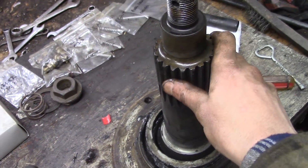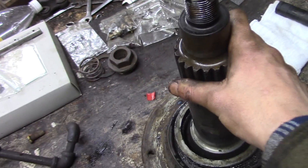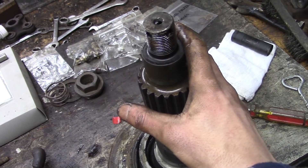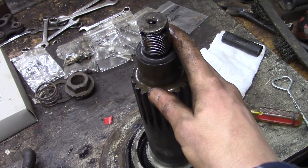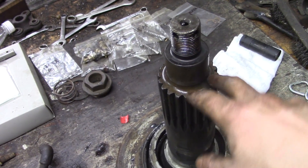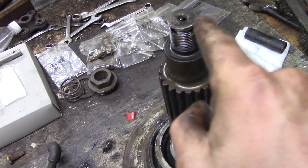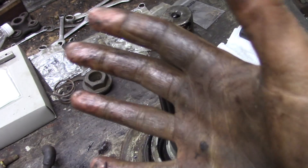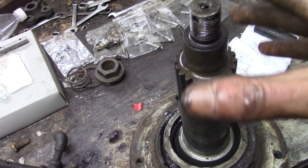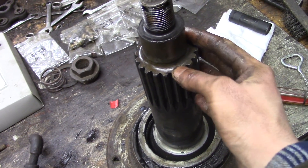This actually reminds me of an interesting story. My John Deere MC — my little beloved MC — a couple years ago the final drive broke. I think I have a couple of videos of that repair. A rock got stuck in the chain, went around to the sprocket, the track got really tight, too tight, and it broke the final drive housing.